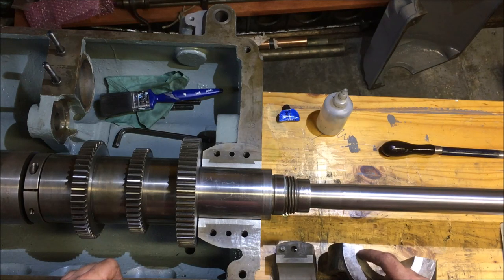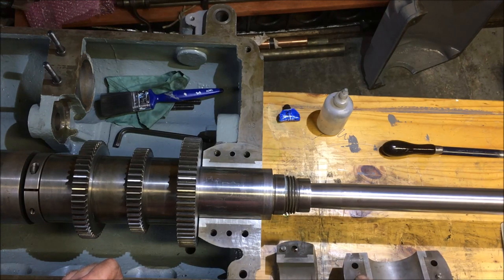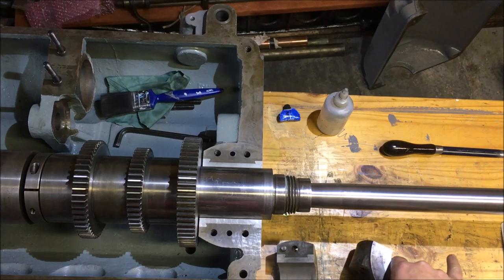But we then want to put some packers in, some shims, so that we can actually make some adjustment as it runs in. I need to see what I've got in the way of shims. So if I've got to come off 7 thou plus a couple of shims, we're going to be in the sort of 10 to 15 thou. I'm not going to scrape it, I'm going to machine it off if I can. Problem is, it's got these dowels on it, which means I've got to either try and get them out, or it's going to be a bit of a spine to basically drop those areas. I think they'll press out. I'll have to see. They might press flat or something. Anyway, that's down the line.